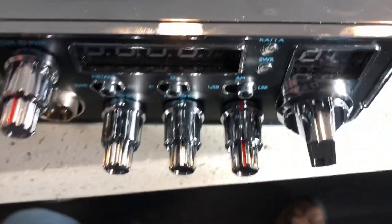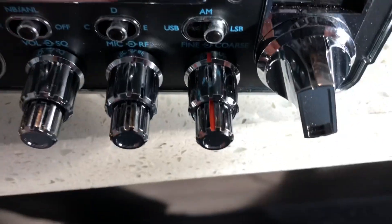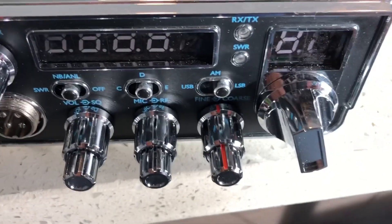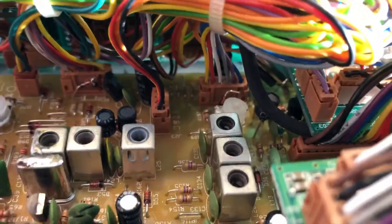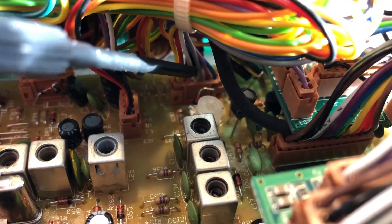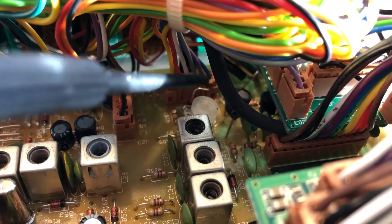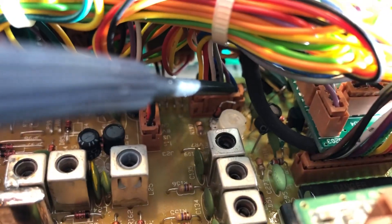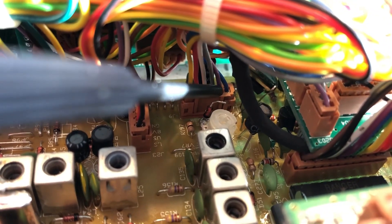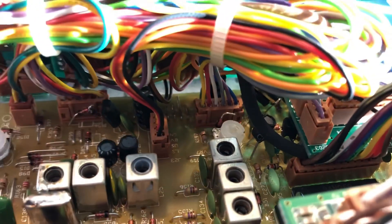The clarifier is now unlocked on the fine, so fine and coarse both track. If you want to see the other side of the board — there's the D-68, and then behind this plug right here, this is that blue wire. That right there is the one that gets the 8 volts, and behind that is R-113 — it's kind of hard to get at. So that's where those are at.